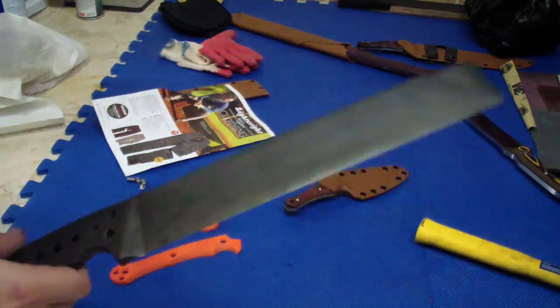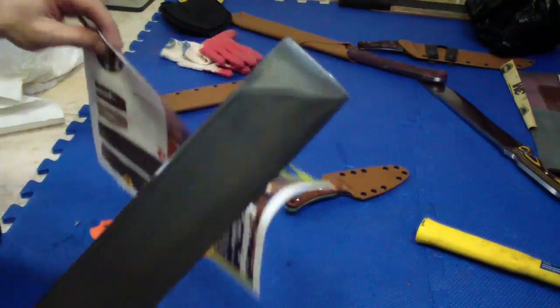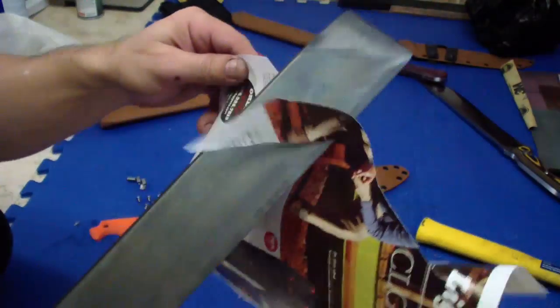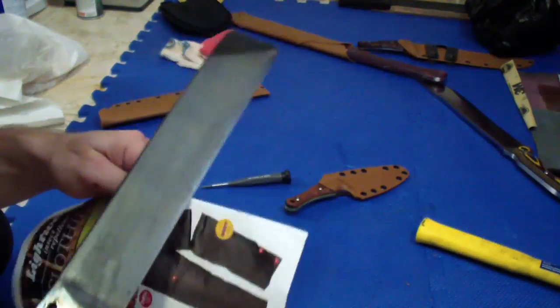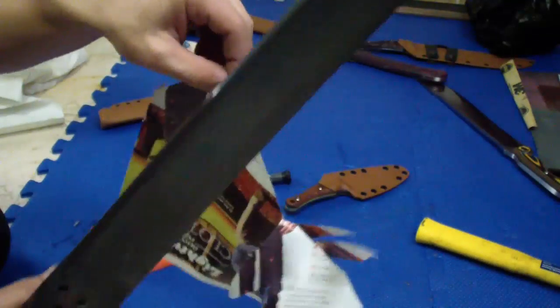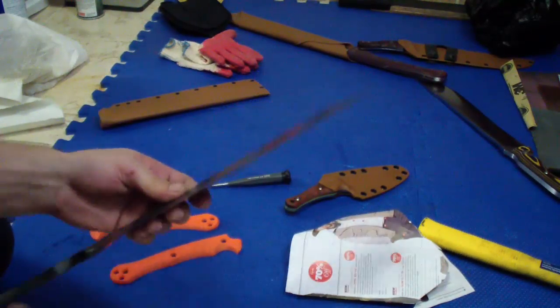Alright, so here it is. After I took it out, washed it with soap real well — everything, including the holes. Going to oil it a little bit. Now, this will need a touch-up on the belt to resharpen it because that super fine edge gets eaten away by the acid. It's still something some people would call sharp — it might actually be a good wood-chopping edge because it's very toothy. It does slice magazine paper fairly well, but it's definitely not what I'd call a sharp edge, so it'll get a slight micro-bevel on a 600 belt and a strop.